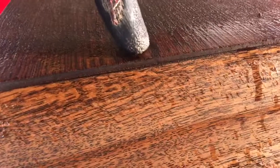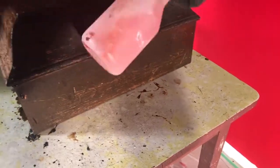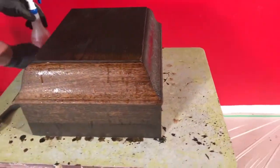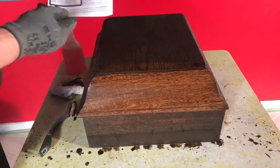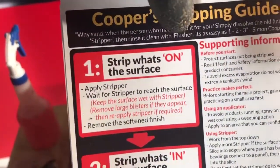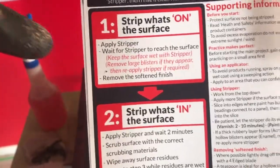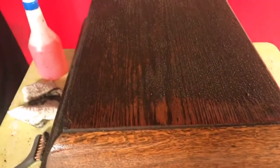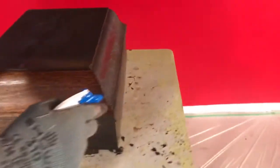It just drinks straight in but it doesn't do any damage to the timber — in this case it's veneer. You can see right at this tip here it's a little bit springy, but it's not going to suddenly peel everything off. So it's ideal for antiques where not everything's as solid as it once was. On our guide it says put the stripper on and keep the surface wet until it's done its thing. Apply the stripper, wait for it to do its thing. In the case of this sort of varnish it's two to five minutes. It's not that it's evaporated — it's just that it's gone into the surface.